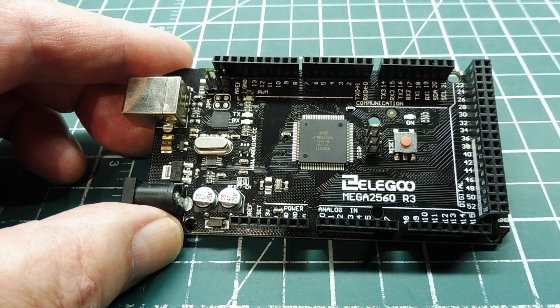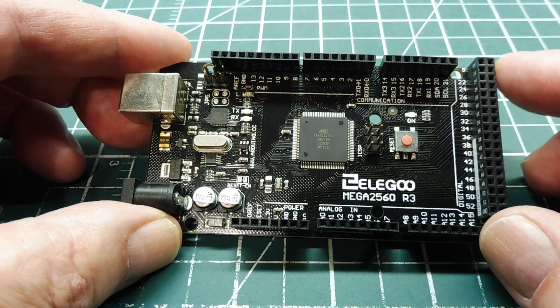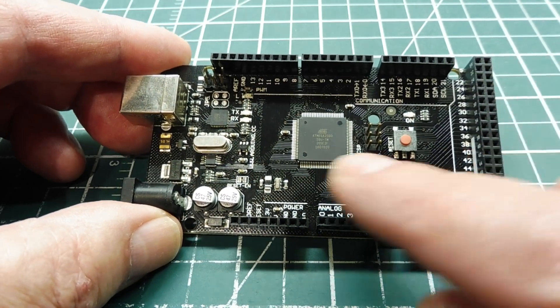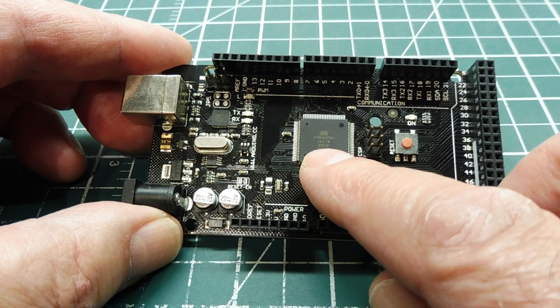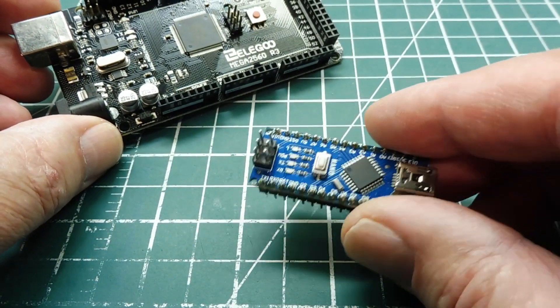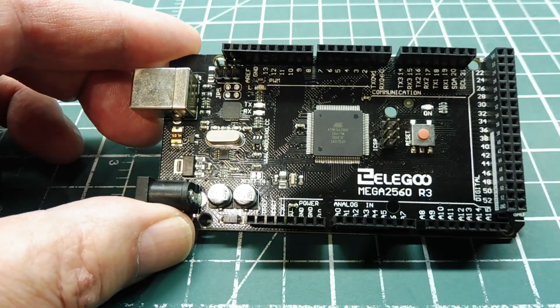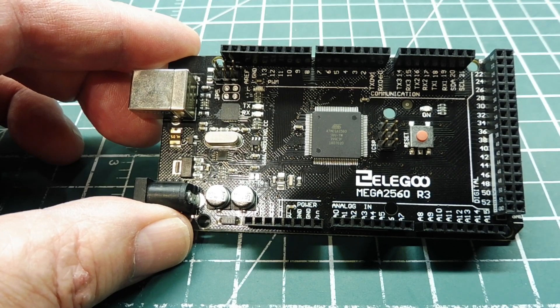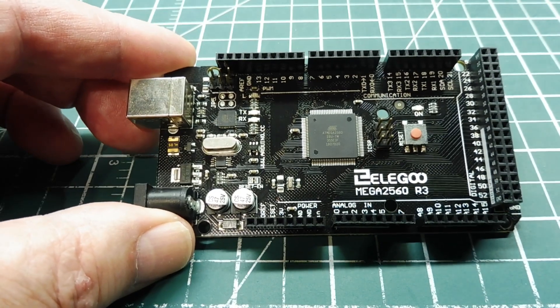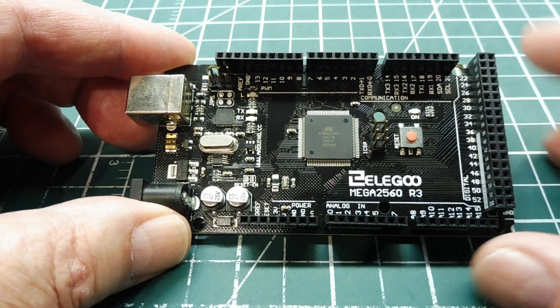In this video, we're going to have a look at prototyping with the ATmega 2560. If you've built any projects using the ATmega 2560, you've probably used this board here — very common. This is the ATmega 2560 chip. It basically has the same core as the ATmega 328p microcontroller, which is on the Nano, but it has more flash, more RAM, more UARTs, SPI, and I2C. So it's basically the ATmega 328p microcontroller with a lot more stuff for bigger projects.